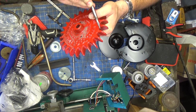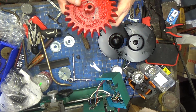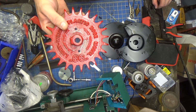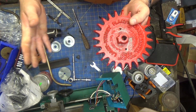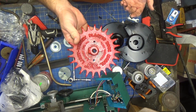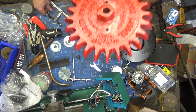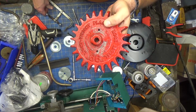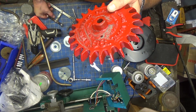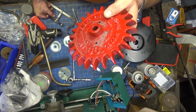So this sets me back quite a bit. This is going to go back to the sandblaster. It's going to go back to square one. And to be fair, it's still hanging up out there, so I'm not going to bring it in. But the body of this, the main chassis of the tractor, I painted with the Hammerite paint, which as far as I know is not related to Rust-Oleum, and it has the same thing. It's the same primer, it's the same metal, it's different paints. The primer seemed to have adhered to this, but the Rust-Oleum and the Hammerite didn't adhere to the primer.